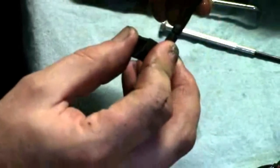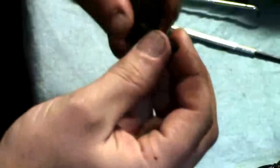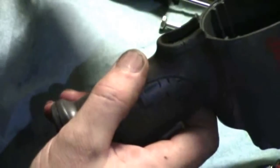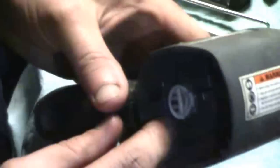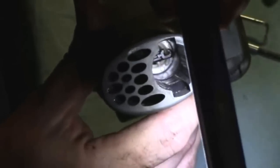Don't press too far up — the top black O-ring can pop up and it's very hard to get back down in there. This is your trigger. You've got a new O-ring to put on your trigger, then just slip it into the housing. Note the orientation of your reverse valve — that tab pointed to one side or the other, the dog ears to touch the trigger.